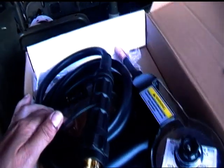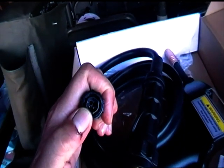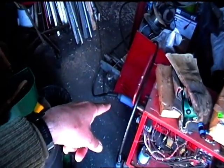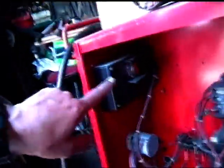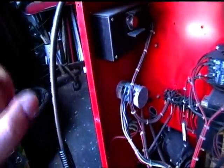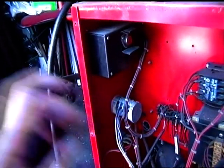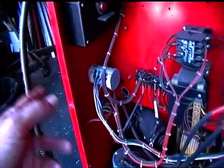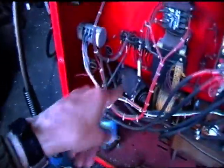So you could say, oh well, just get an extra battery and connect your 12 volt DC to those 2 pins there. Problem is, you've got to have a controlled speed on the motor, and the control of the motor speed is all done probably pulse width modulated through the circuitry, which is all inside of here. So that's a pulse width modulator. It controls DC pulses which are run into the motor. So it's basically gaps and pulses, so pulse width modulation. That's what controls the motor speed.